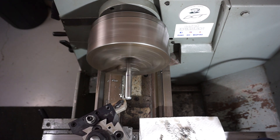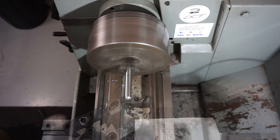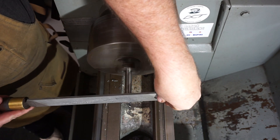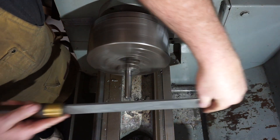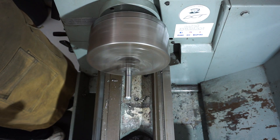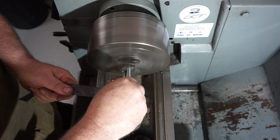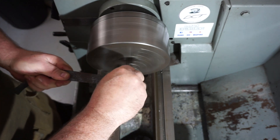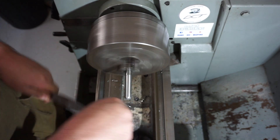I've switched over now — I believe this one is the 5/8 inch shaft. It's a lot harder than the mild steel. You can see there I hit it with the file and it didn't really do much. I would say it's a bright mild steel and it's obviously cold-rolled — that's why it's so hard to cut.